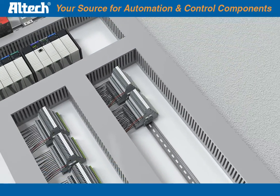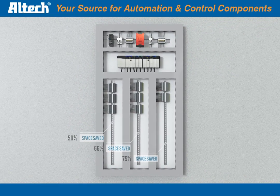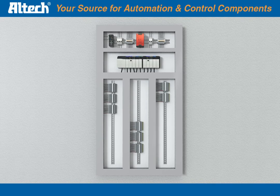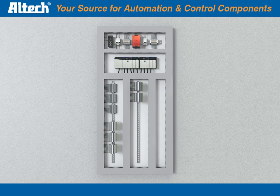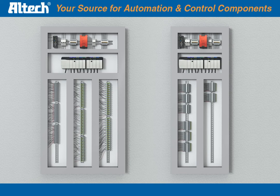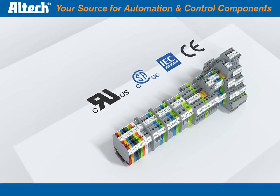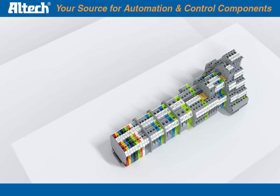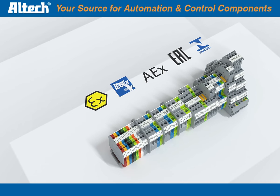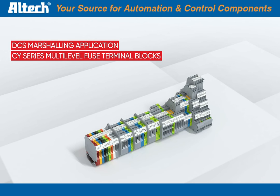Why is all this such an important breakthrough? By saving space on the DIN rails, these terminal blocks give you room for future expansion. Additionally, space savings on DIN rails also translates into overall reduction in cabinet dimensions, saving expensive space inside the control building. The high-performance CY series terminal blocks have been certified by all international standards and have 5 different HASLOC certifications, making these CY series terminal blocks an ideal choice for DCS marshalling applications in all process industries.